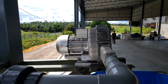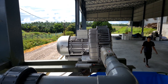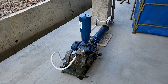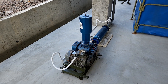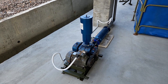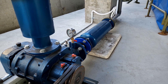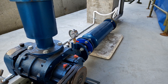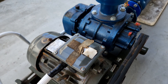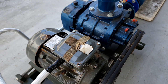For the nursery, using this ring blower is more than enough to supply most of the aeration. For our growout tanks, we do not use ring blowers — instead we use some of these root blowers that I have shown in previous videos. This root blower is a 2 horsepower unit and it's capable of providing aeration for my growout systems. We actually used the motor from the previous air blower and just refitted it over this new root blower.